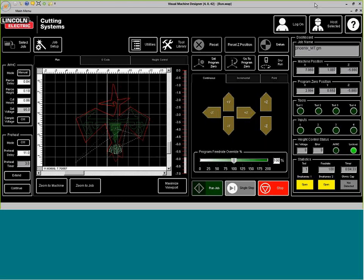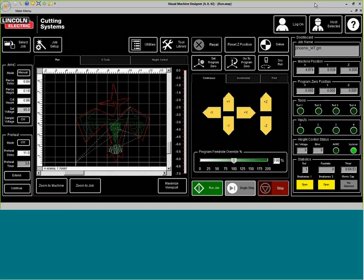We get done with this design. We went from generating a rectangle to making sure that the offset was complete, and then we went through the process of generating a multi-tool file for this project. Now, what we have done can be used with either plasma or plate marker, or if you wanted to set up different types of feed rates for different portions of your design. If you have a plate marker, then I definitely recommend going through your plate marker and setting up different types of tools with different diameters and different spacing, different looks of the design, and then you can play around with it yourself.